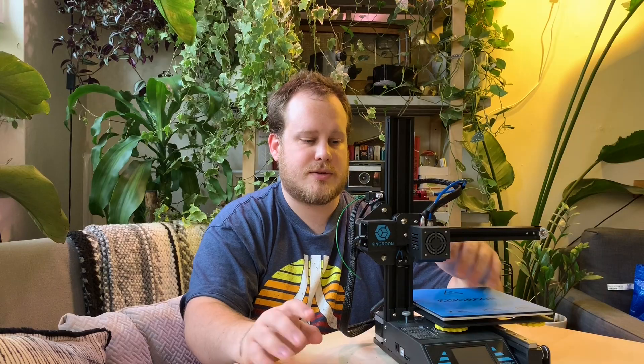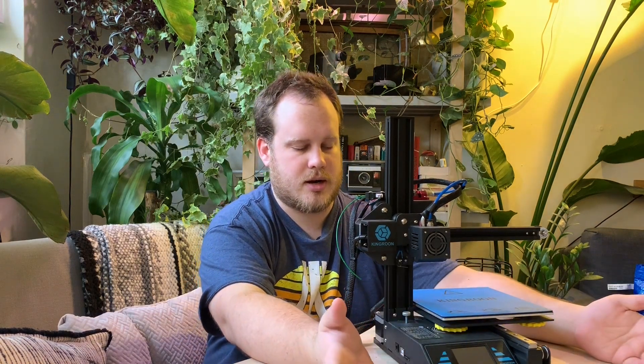Like I mentioned in the previous video, this printer has a few really cool features. It has an assisted bed leveling feature where on the touch panel you select that option and choose which corner you want to do. It has a set of different locations you can check the levelness at — you press those, everything homes and moves to that location, and then you just adjust so that the bed is the correct distance from the nozzle.